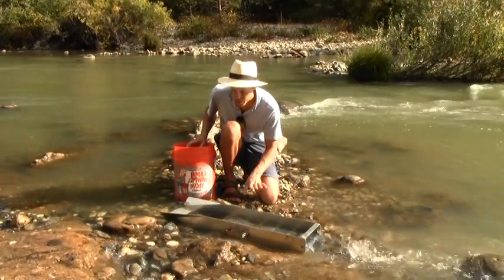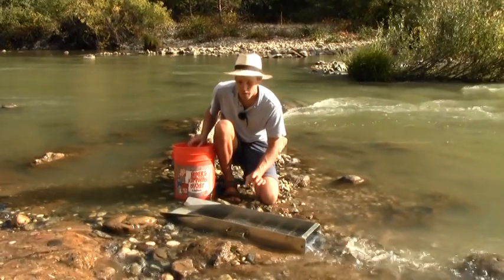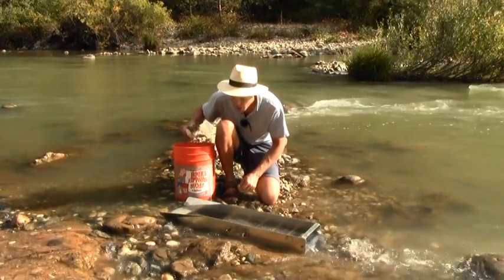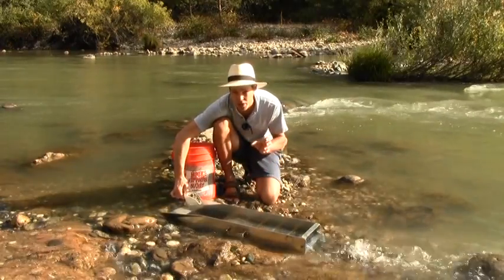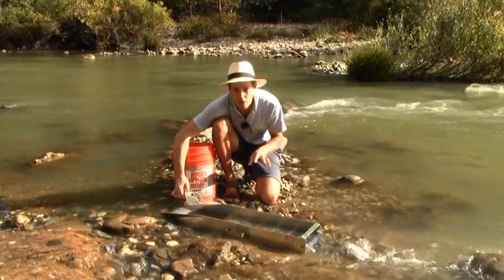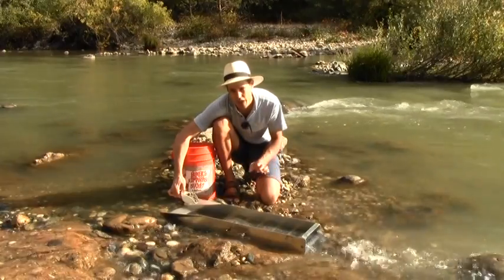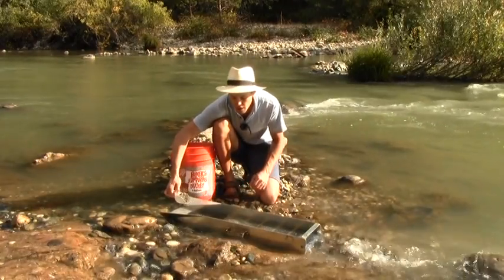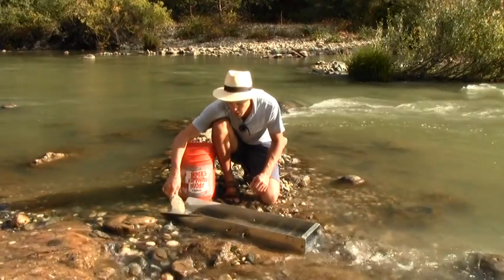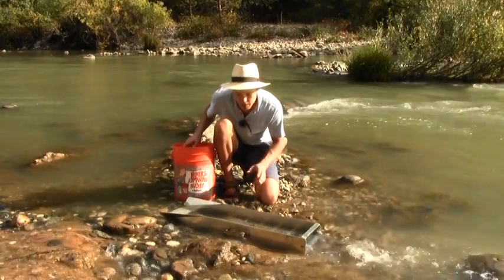It's set up satisfactory — it's got a little bit too much water running through it, but not enough to make any difference. There is a little bit of flexibility in this; it doesn't have to be perfect. You won't really know how it's going to run until you actually drop a scoop of dirt in it, which is what I'm going to do now. This is a scoop of our classified dirt. You never want to run the big rocks through it without classifying it, because those big rocks will sit in the wrong places, make weird eddies, and you'll lose gold that way. You always have to have your dirt classified — usually about a quarter to a half inch screen. You can dump it slowly or dump a whole scoop all at once. It doesn't really matter.